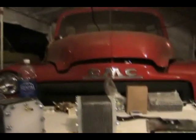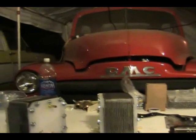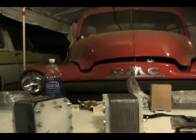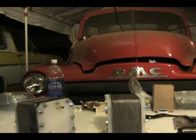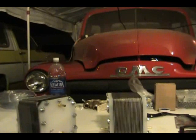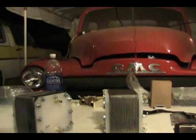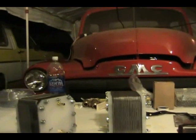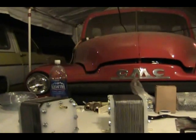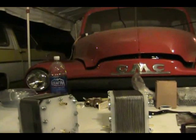Everybody has their own opinion about electrolyte concentrations. I prefer very weak solutions — they're safe to handle, they spill all over the place and it's not a problem. It's not much different than a cleaning solution. Using that, it's usually about 0.25 to 0.33 amps per square inch. So if I wanted to sit down and figure out the math on this, I could — that would tell me how many amps this cell would draw at what voltage.